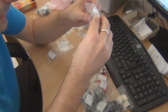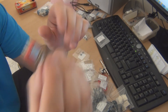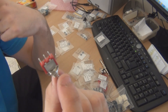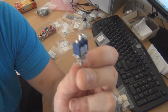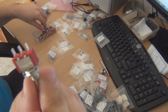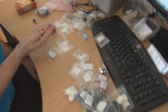Another thing is the switches. I haven't soldered onto them yet, but if I had to take a guess, the solder lugs won't melt. They don't look like the cheap ones from Futurelec. That's a cheap one from Futurelec — have a look at that lug, it's already fallen into the housing of the switch. Absolute rubbish — don't bother buying those switches from Futurelec. These look much better. I've got some quality ones I've been using for a while and they look pretty much the same. So I'm anticipating they're going to be good quality lugs.